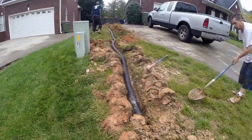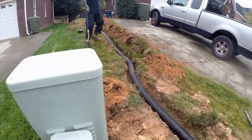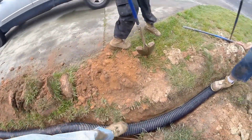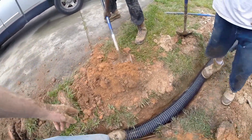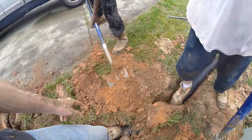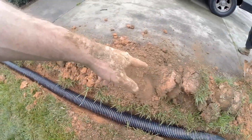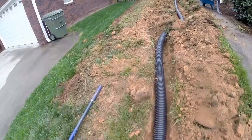Now we're backfilling. We've got some really crappy clay — we push it into the trench, then take the shovel and just chop it all up so it becomes much finer particles. You can see the difference in soil types: out front we have white clay, back here there's red clay, which is a much denser clay, but it's the same process — put it back in the trench, chop it up, and it'll settle back very nicely.